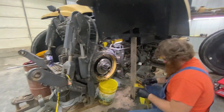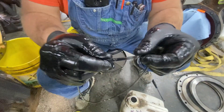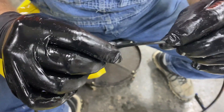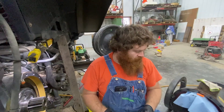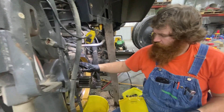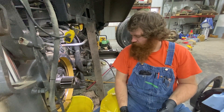We've got the correct parts today and Shadow is putting in the square-cut O-rings. He thought he nicked the old one taking it out, but on this side it was slightly chewed up all the way around — and it may not have been releasing pressure off the brakes when we quit turning, which may have caused the premature failure of the clutch disc. The new O-ring is in there already lubricated with new hydraulic oil, and we'll slip the larger O-ring on through the piston, then put in our clutch discs and go down the list.